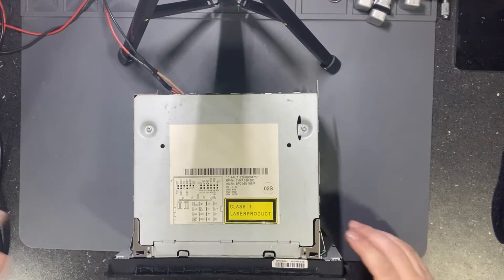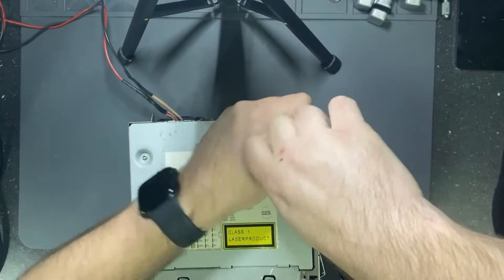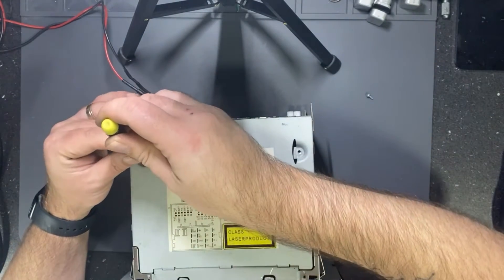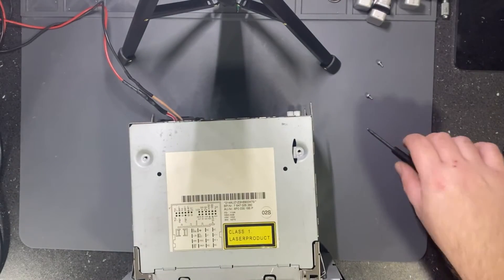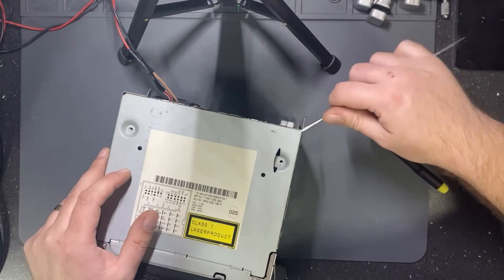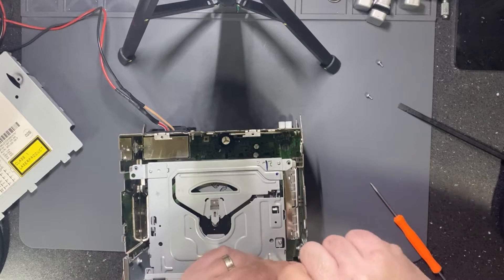I will turn off the power supply and remove the back cover. Inside we should find an EEPROM — it's a 95128, but let's see how hard it is to get to. After that I will use the TL8663G programmer and the software called CALPGEN in order to decode this type of unit.